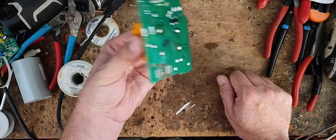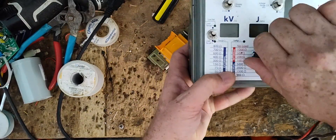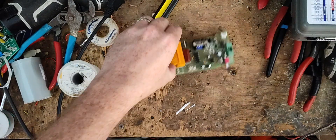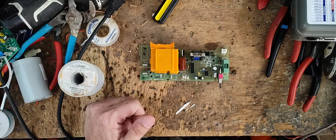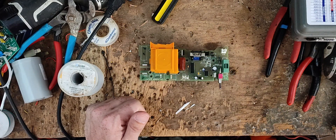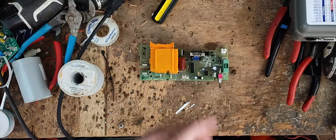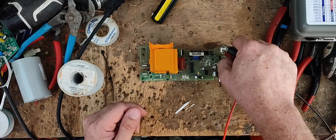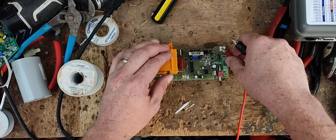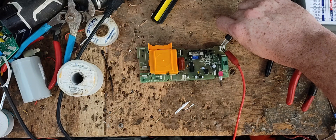So he's probably got either a bad battery, a bad wire, a bad connection, or the wire itself is bad. He needs to get a new wire or start trimming back. Other than that, nothing wrong with it — it works fine. Let's do a thorough load test on it. This unit is set up at 0.17 stored joule, so the output is probably around 0.1 joule — not a knock-you-to-the-ground kind of shock, but for what these are designed to do, they do the job. The S-17s were really well made — they were around for 20 years.